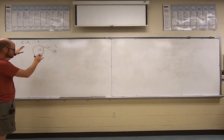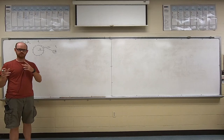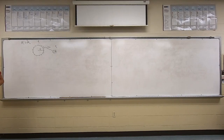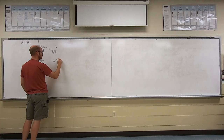When they attach, and the surfaces essentially become one in an electrical sense, not in a physical sense, what happens to the voltage? What happens to the relative electric potential on the surface of these spheres? As it turns out, the voltages become identical, and that'll make more sense as we go forward. But what we can assume is that when the charge of Q1 and the charge of Q2 are connected through this wire, they will evenly distribute themselves over the surface of both of them, such that the voltage of sphere 1 over here is going to be equal to KQ1 over R1, and voltage of 2 is equal to KQ2 over R2.